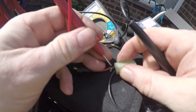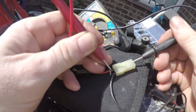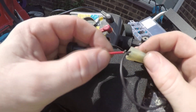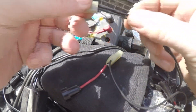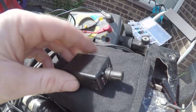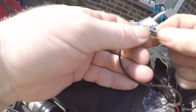There is absolutely no connection between here and from this solder pinpoint to this wire. There's nothing. So this will explain why my chain oiler has not been working very well at all. Now because that is so close to there, my only option is to take this off here and literally solder the plug — take the plug off and solder it together, which we can do because this can come off easily.